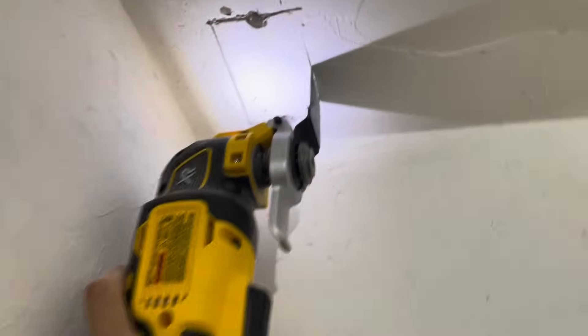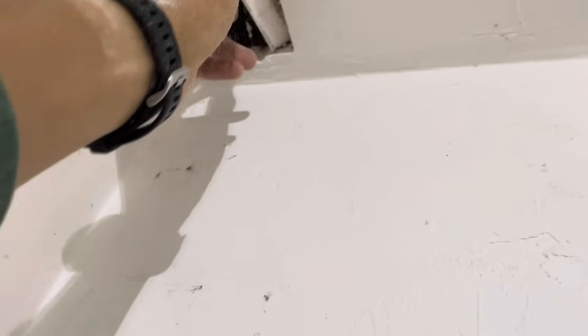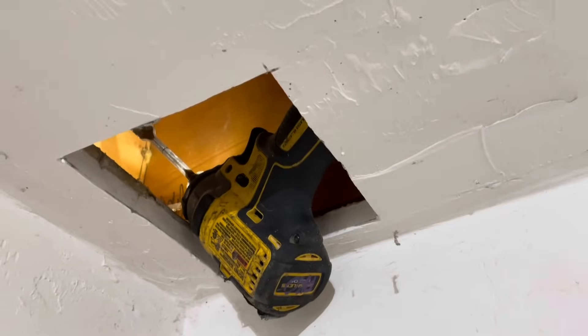Thank God for the oscillating multi-tool — I was cutting this by hand and realized I had it. So the little access hole is cut out. I'm going to try and get this out safely — there's a wire up there! It's a good thing I didn't cut that, which is why you don't use a jab saw. I can see I have a joist up there so I have to enlarge the hole to get over it. Now I've drilled up but there's an obnoxious sheet of plywood which makes things a whole lot more difficult. Originally if this plywood weren't there the joist above would just open to the soffit, but now I have to drill above the plywood which makes fishing a lot harder.